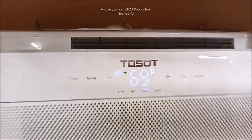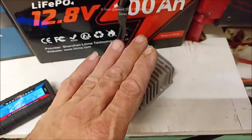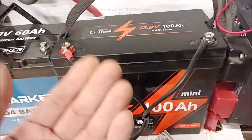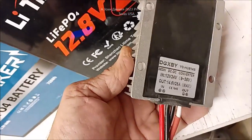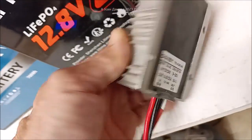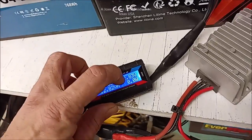That thing runs all night long — that's the most efficient air conditioner I've ever seen. This is how we take the power during the daytime and evenings and charge up lithium batteries safely. This is a 20 amp — it says 25, but that's a short peak level, it's 20 amp ability. It'll charge at roughly 15 amps. Right now it's at 12.83.